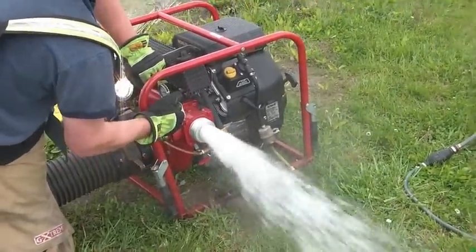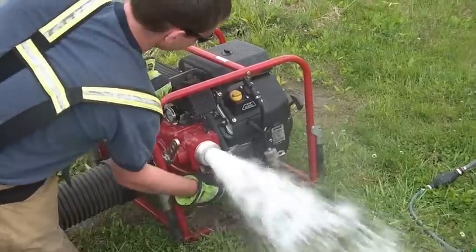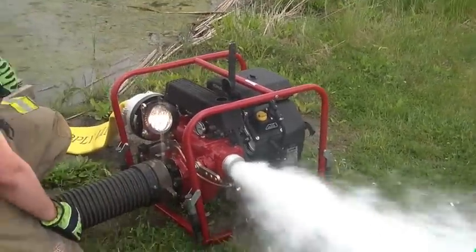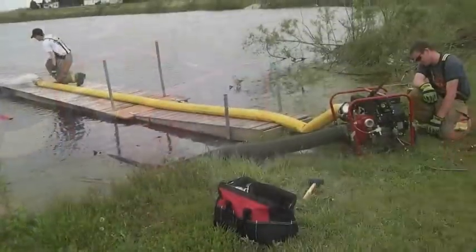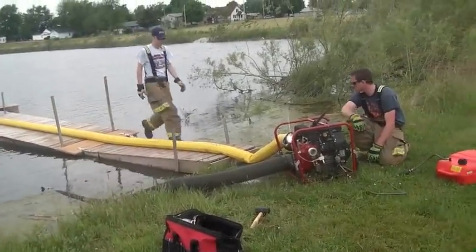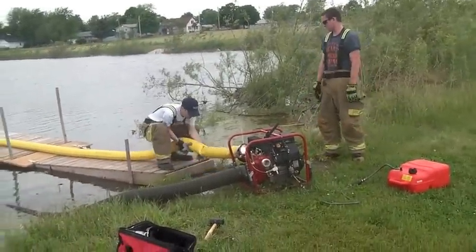Open the desired discharge, close the priming valve, and release the exhaust lever. Adjust the throttle as needed. You are now ready to flow water through large-diameter hose to the destination. Be sure to remove any kinks from the large-diameter hose to minimize friction loss.